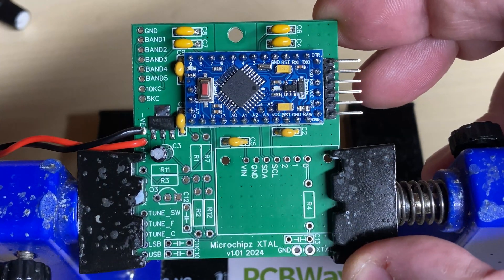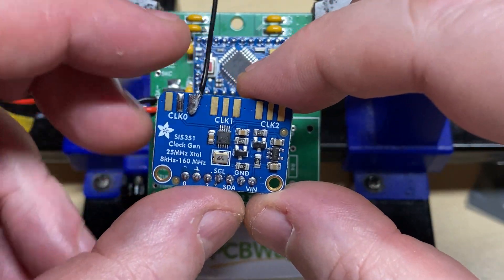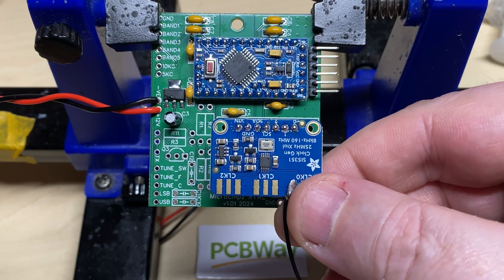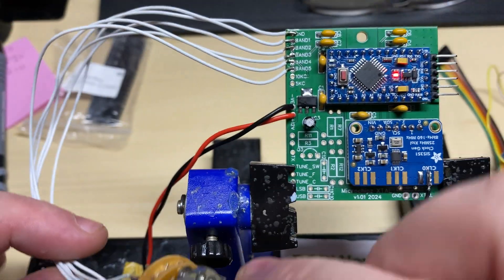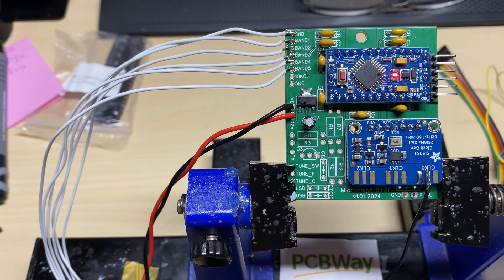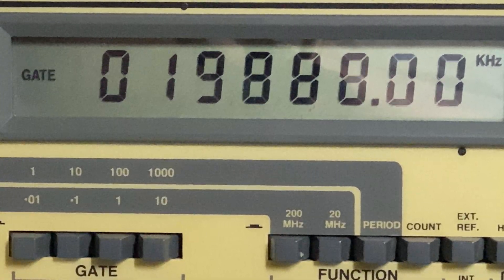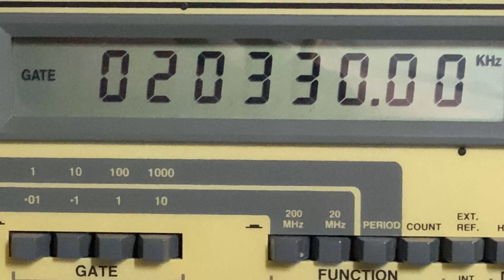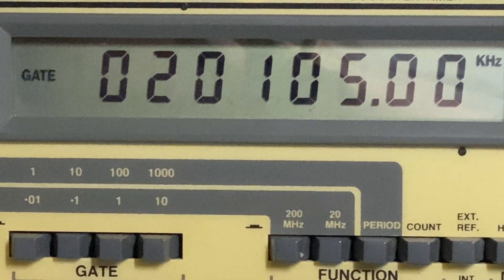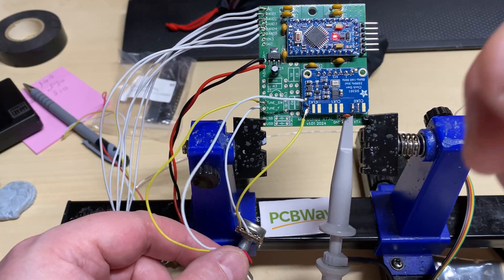I've fitted a few more components — a few more of the bypass capacitors. There's our crystal generator board that we're going to be using, the SI5351. We're just going to be using one of the clock outputs, and there's my test band switch — I've just hooked that up for testing. I've got the output hooked up to the frequency counter. I've already done the calibration — if you want to know how to calibrate these, John Hawkes has done a good video on these using the Etherkit libraries. As you can see, these are just the standard Cybernet crystal frequencies for the crystal oscillator board.